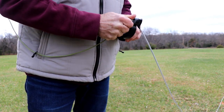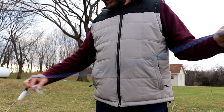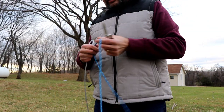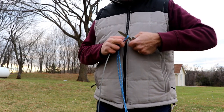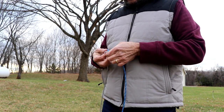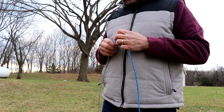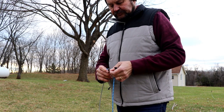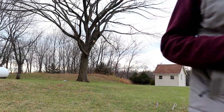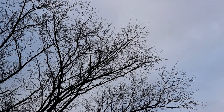Once that's done, I'll take the end of the antenna and tie it to another loop at the other end of the cable. I could have just put the cable right through the insulator on the end of the antenna wire, but I prefer to have a couple of feet of completely non-conductive material between the antenna wire itself and whatever I'm using to pull it up if I'm using something that's steel or conductive. It's probably not really necessary but it eliminates a little bit of capacitive coupling — that's just my preferred method. Then I'll finish taping and tying off this end, and go back to the other side of the tree to grab the paracord and start pulling the whole assembly back up into the tree.